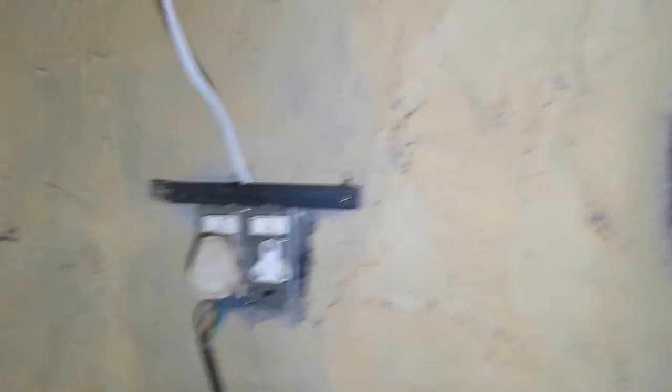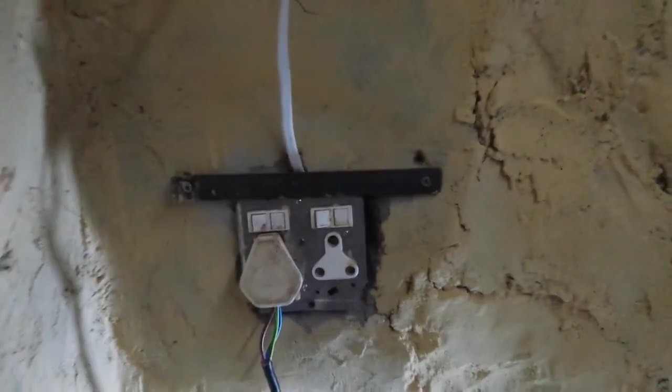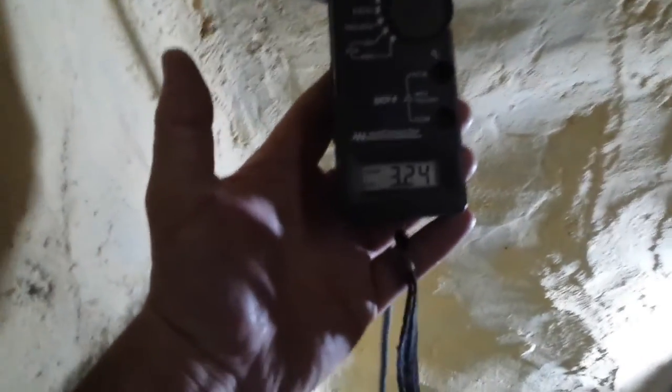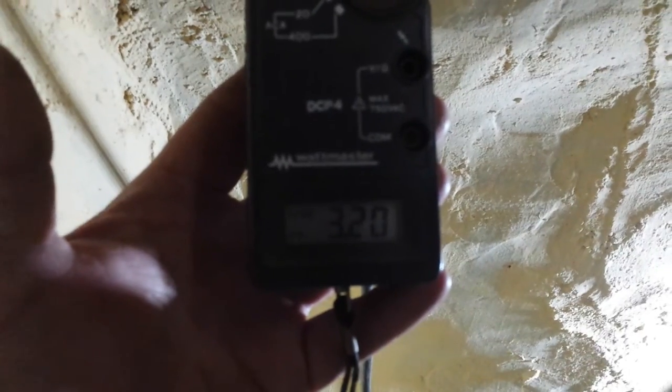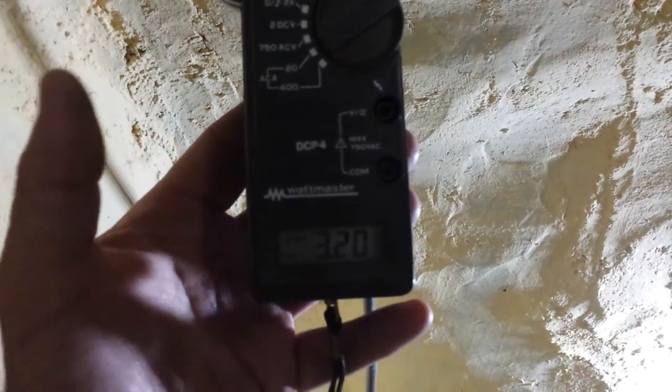And just to make a comparison — this is actually quite interesting. Over here is an older model single door Coke fridge. I've done nothing to this; the compressor is still inside. I want to go ahead and turn it on so I can put the clamp meter on it to show you what a 134A single door fridge runs at on electricity. 3.3 amps — 3 amps of electricity. So how is this possible? 134A single door: 3 amps. R600A double door: 2 amps.